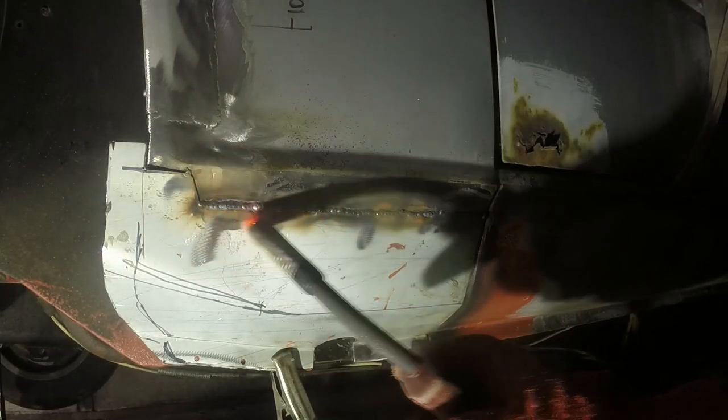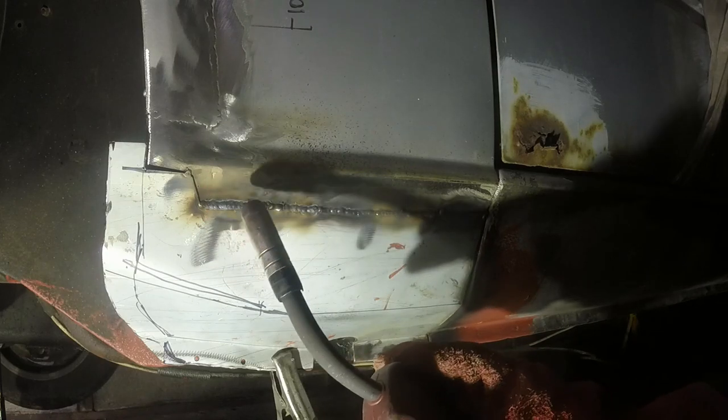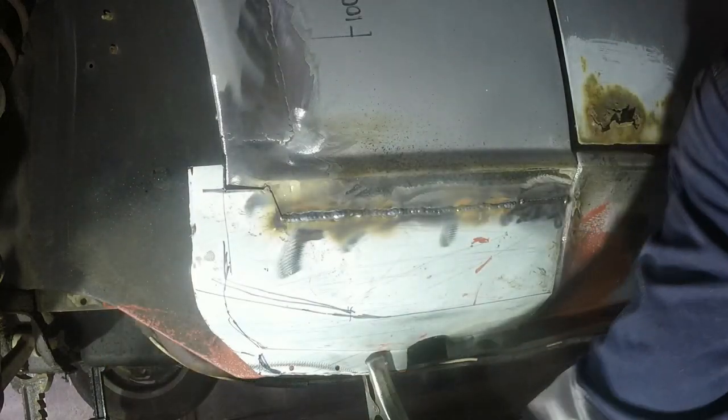See, that was a lot easier for me. They've sat flatter because I kept the heat in there, and because I was going straight on to basically a bit that was still red hot molten metal, it was quite happy about it. And then this one, I'm going to use the gravity to help me come down here. I will clean it off.